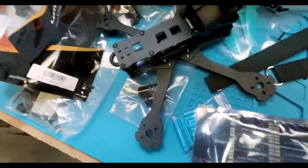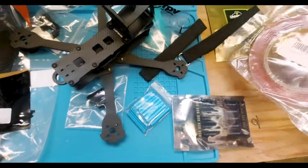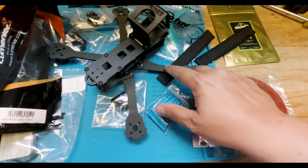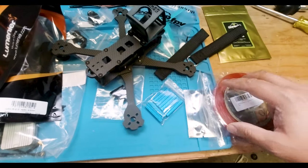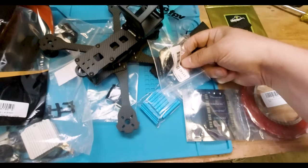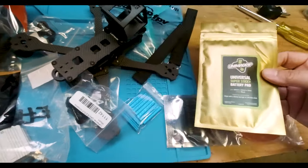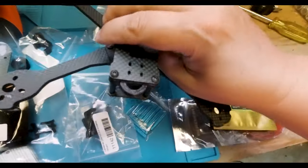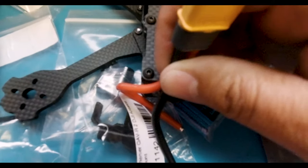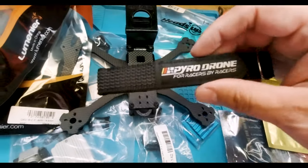For easy motor changeouts I'm going to try using race wire for the first time. I also have the VHB clear tape - I'll put that down, route the leads to an equal distance for each motor, then put the race wire over it. That's going to allow the 3D TPU part to sit nice and flush. On top I'm going to put the oh-my-god grip, which I really like. The 3D printed part will also route the battery leads so I don't have to drill the top frame.